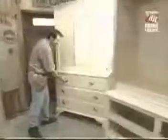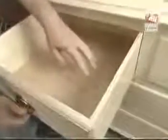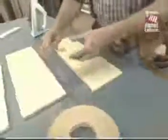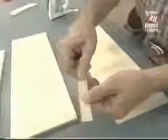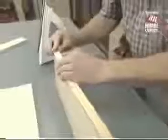One change that we're going to make to the project is with these drawers. I made the sides and bottom out of pre-finished plywood, but I left the laminations exposed, and that's a giveaway that it's a modern piece. So we're going to treat those edges with some edge banding, thin pieces of wood that have an adhesive applied to the back. I can activate that adhesive with heat. And in this case, I'm just going to use a simple iron and just press it on.